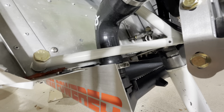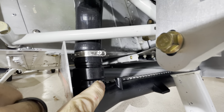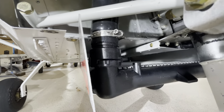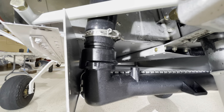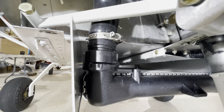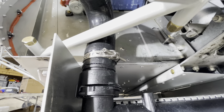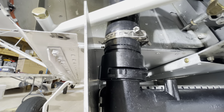We have these adapters for the radiator — high temperature nylon-filled adapters. There's a little wire you can pop out and the whole adapter will pull straight up, allowing you to disconnect the radiator hose very quickly, similar to fuel quick-disconnect fittings. Lubricate it with O-ring grease and pop it back on. Right above it we have an Oetiker clamp — slightly different from the crimped type, these have a screw so you can reuse them. They have little notches when open so you can adjust the clamp size a little bit before you install it.